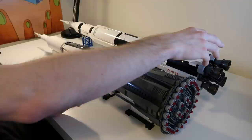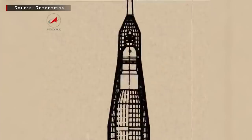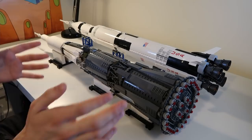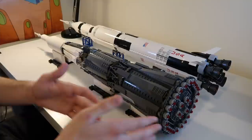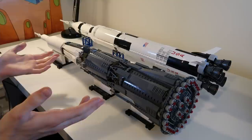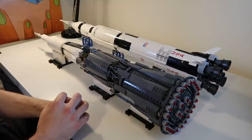The real reason this rocket failed is it had one tenth of the funding of the Apollo program, and that means it didn't have the funding to create the testing facilities necessary to do integrated tests of all the stages. The only way they could test any part of this rocket was to launch it. Having a lot of engines means a very complicated plumbing system, and most of the causes of the failures would have been identified in an integrated ground test — but they just weren't able to do them, so they couldn't work out the kinks in the plumbing system.